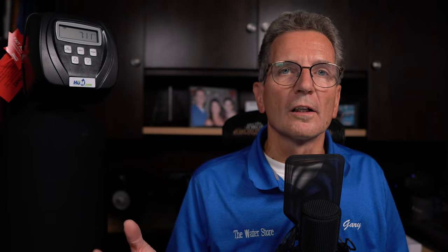Some water softeners have a different style of bypass. The Aqua Master and Water Boss have a graduated bypass valve with a knob on top — you point it 180 degrees from service to bypass. A neat feature is that you can leave the bypass valve slightly open to mix some hard water with soft water, so instead of getting a softness of zero, you'd get maybe two or three. That's the only brand I've come across with that feature.